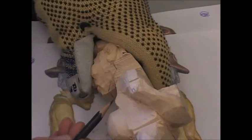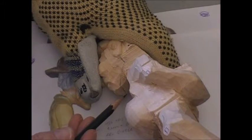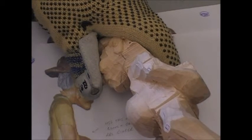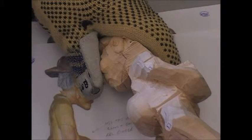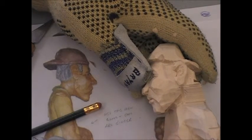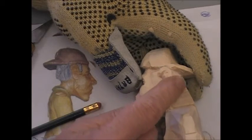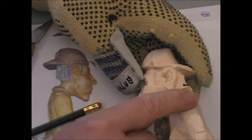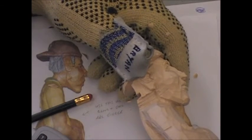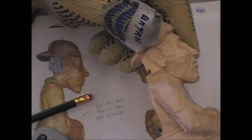The wood we remove is the wood below that line to create the jawline — it's identical on the other side. To make sure the symmetry stays, draw a line straight across the bottom so you know where the chin is going to be, and that will orient it on the far side so you can make them match. I'll put a V-tool in there — a gouge would work fine, the number 11 would work in there. You can see a definite jawline there. Eventually we have to remove the wood behind here, but only once you decide on what type of hair and collar you want. Notice that I've hollowed out a little bit under the chin as well, so you can make the chin kind of hang down.